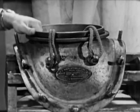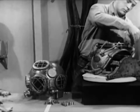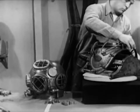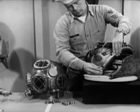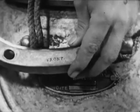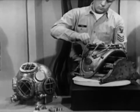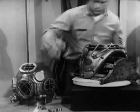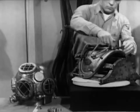Next, try the fit of the breastplate straps on the breastplate. They should go into place easily and conform to the curvature of the breastplate. Notice that to avoid mix-ups, the front straps are clearly labeled. Turn the wing nuts down on the studs to make sure that no threads have been damaged since the last use. The copper and brass of which the outfit is made are relatively soft metals, and the threads are susceptible to damage from careless handling.